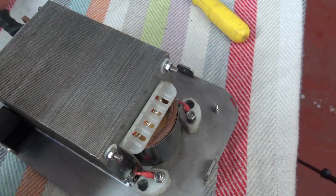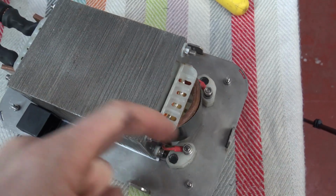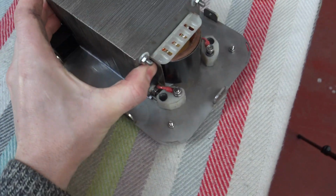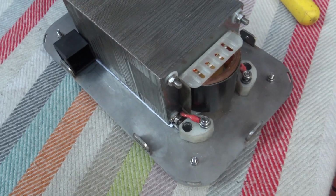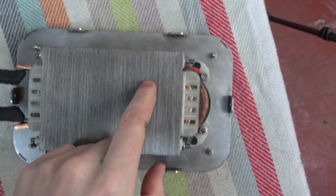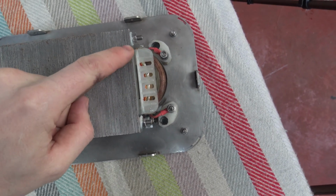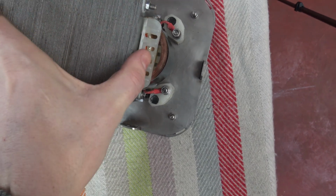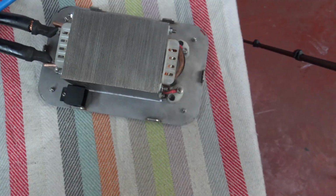This winding basically comes down through the core here and back up through. You can see here I have the transformer E&I laminates squashed together with a 5mm threaded bar. Now if you look closely at this transformer, you can see a slight radius here. That's because there's that much tension squeezed here. Really, I should probably have a plate against this, but it's okay, it works.